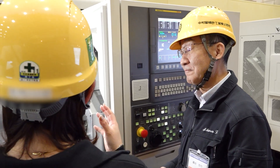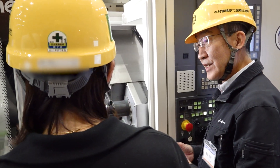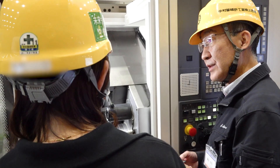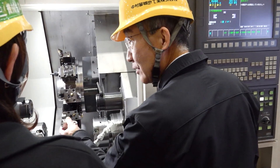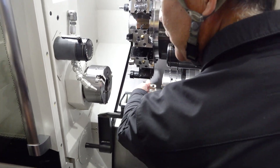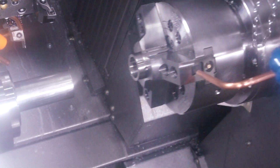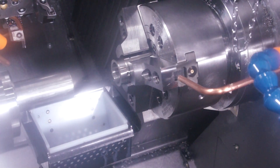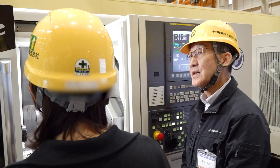So what do you do to drop a work piece into the bucket? Generally, it uses an ejection device that puts the work piece out from inside the spindle shaft. There are many ways to push it out — such as simple air blowing, using a spring port, or an air cylinder. It depends on the customer's specifications.